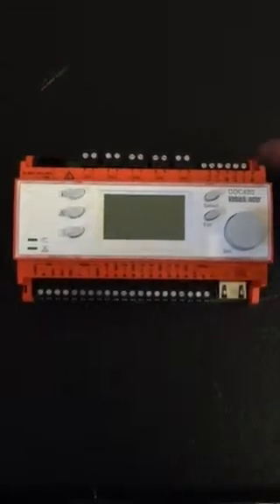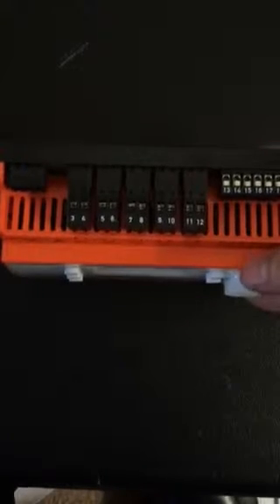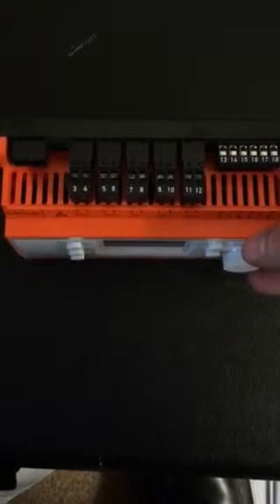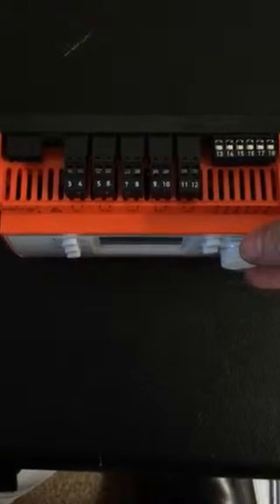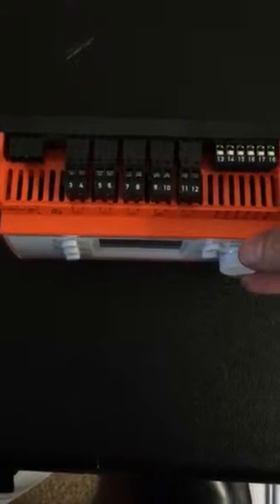Just some key things that you need to be aware of. The controller has lots of air vents and does push out a little bit of heat when it's mounted inside the cabinet. These vents are top and bottom, and they're a natural place for nasty little things to get into the controller such as swarf or any cable cuttings that may be flying around the control cabinet.